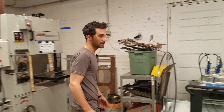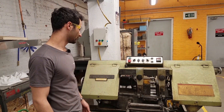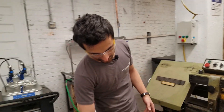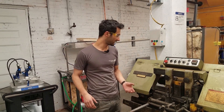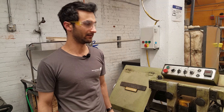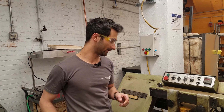In terms of safety, in addition to the eye protection that you're always wearing in the metal shop — no gloves. Maybe when you're handling something with sharp ends while you're handling it, that's fine. But in general in the metal shop, unless it's for something hot or something with sharp edges, you don't want to be wearing gloves around spinning things — they can get caught. And versus a finger really getting cut, the whole glove will get pulled in and you'll have a really bad time.